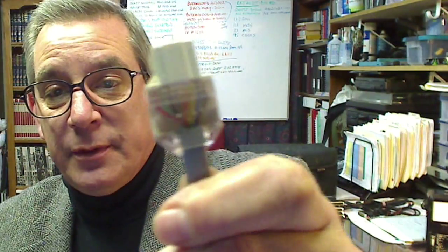This is a T1 reversal. I used to make these myself until I found you could buy them. I don't even remember where I got this or who the manufacturer is, but it's got a part number on it. It's a nice crimp on the jack side and the plug side as well. And you notice it's made out of flat satin — it's not made out of round cable. Now you can use round cable and that's okay.